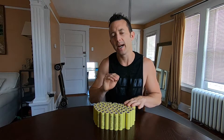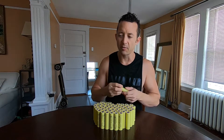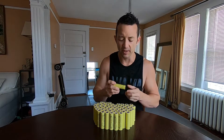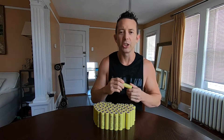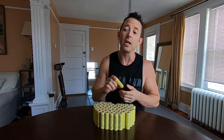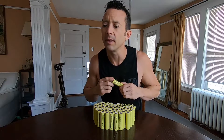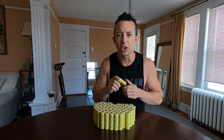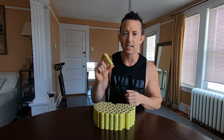I am going to do a high discharge test — I've got a couple resistors coming, those haven't showed up yet. So far I've been using my imax B6. I charged one up and I'm currently in the discharge phase, discharging at one amp. It's slow as molasses — it timed out once after the two-hour mark, but we're at about two thousand milliamps right now and still going. We're at 3.28 volts under load with 1300 milliamps discharged, so we're right at 3300 milliamps and right on pace to get to 4000 milliamps.